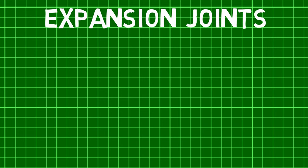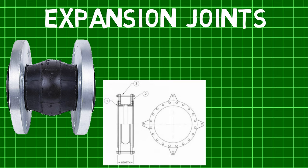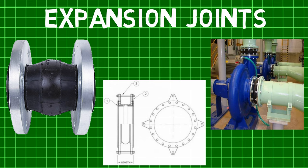Another special type of pipe joint is expansion joints, which are necessary for systems that convey high temperature substances such as steam or exhaust gases, or to absorb movement and vibration. A typical joint consists of bellows of metal, plastic, fabrics, or an elastomer such as rubber. A bellows is made up of a series of convolutions designed to withstand the internal pressures of the pipe but flexible enough to accept axial, lateral, and angular deflections. Shown here is a pneumatic blower inlet and outlet rubber expansion joint with its bellows made out of rubber.